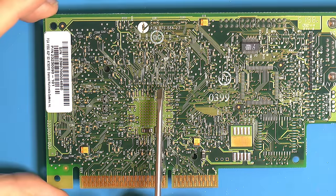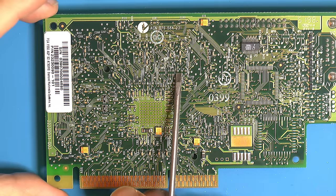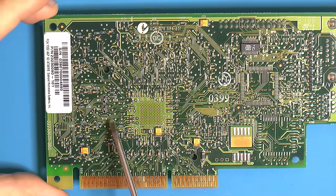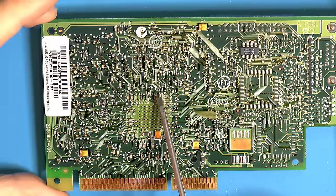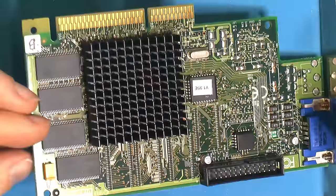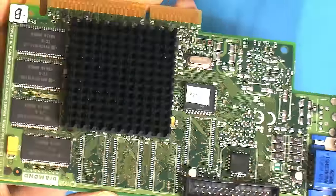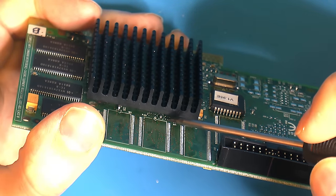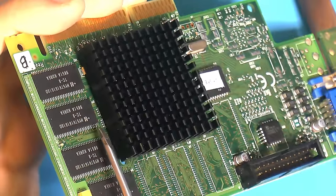Why I look for this is because over here we have 2 empty slots for resistor bridges, and we've got those 3 slots here for ordinary resistors, and none of them are occupied like there are over here. Also we can notice here that it says RP5 for that, RP6 there, and over here it says RP1 and RP2. So where is RP3-4? RP3-4 must be somewhere, so I flipped it over. I can't actually see what it says on them, but there are 2 bridges in there. So I looked over here. It's gonna be difficult to see, but somewhere in here we got 1 slot there, 1 there, for RP3 and RP4. So I'm guessing that's RP7 and 8.